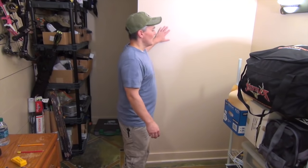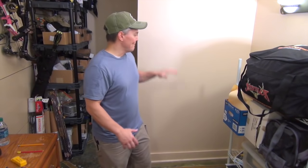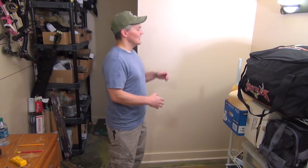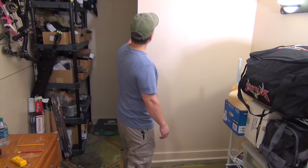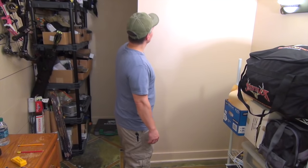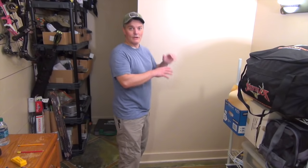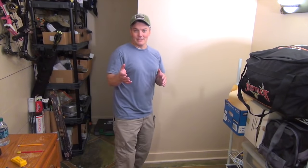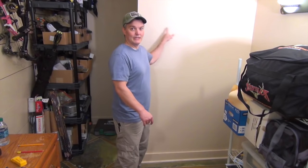This wall right here, after looking at all the different walls in the basement for location, is actually the only one that doesn't have a power box of some kind in the stud space. It does create a few extra challenges — everything is a little close to the edge — and I might have to tie the two studs together and mount it a little off-center. My stud sensor is also dying, and it looks like there's actually non-standard spacing here — it's a little big.